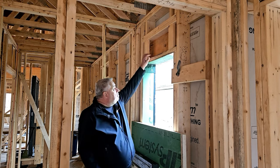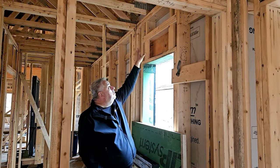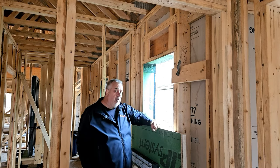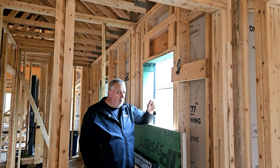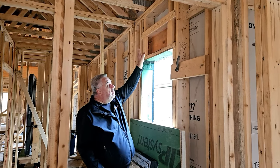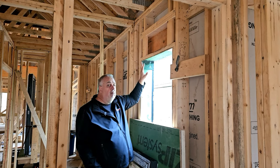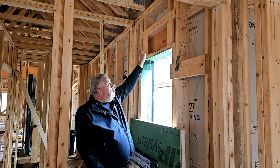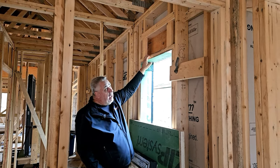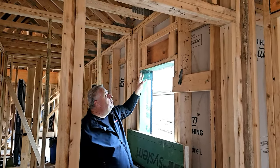You can see the reason of the pocket header is to create a pocket. We have our head plate there. Now, this was Offsite Framing Harvest Homes — they're a little aggressive in the amount of wood they use. There's no need for the double plate up there; we could have gotten away with the single plate. But anyways, we have that single plate, a single-ply LVL there, and then we have what I call the head plate, which basically just closes off that opening.